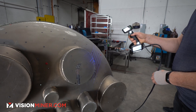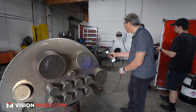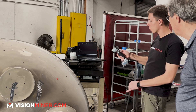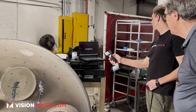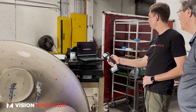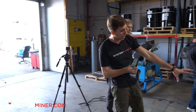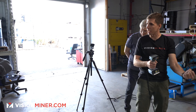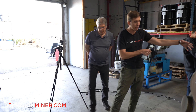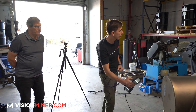As we were demonstrating to these guys, scanning with the HX is very simple. You just need to spend some time ensuring you hit all sides of whatever you're scanning and make sure all the collected data is good and solid. When using structured light mode, I pick an area with some features as my anchor point, so if I scan over here and it loses tracking, I can come back to where it knows where it's at. Then I just hit go.